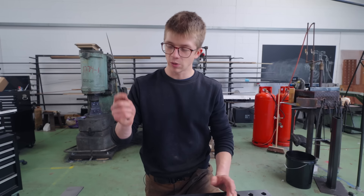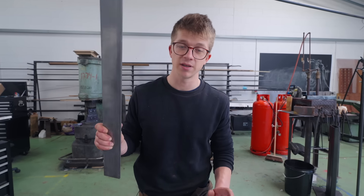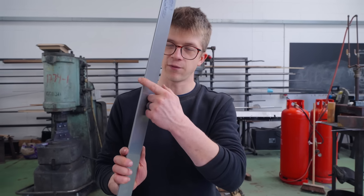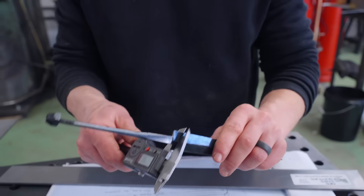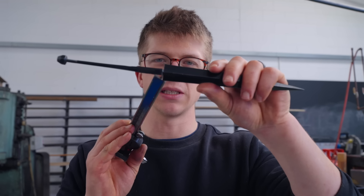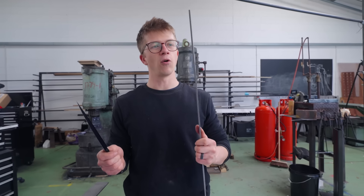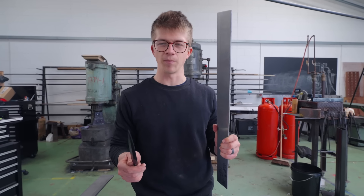I want to make our blade out of stainless steel for the corrosion resistance. Just in case, I have some 6mm thick 1080 carbon steel, but what I'm hoping to have success with is this 14C28N stainless at 4mm wide. The reason I'm a bit iffy is the original is 4.8mm thick at its largest point, so we're sacrificing a little bit of material. This one is already very stout and I think it could afford to have a little more flexibility. Despite the funky tang design with the possibility for stress concentrations, the tang still feels plenty strong. The end result of a blade made from this 4mm thick material — if it's as sturdy as we'd like — it's going to be a laser.